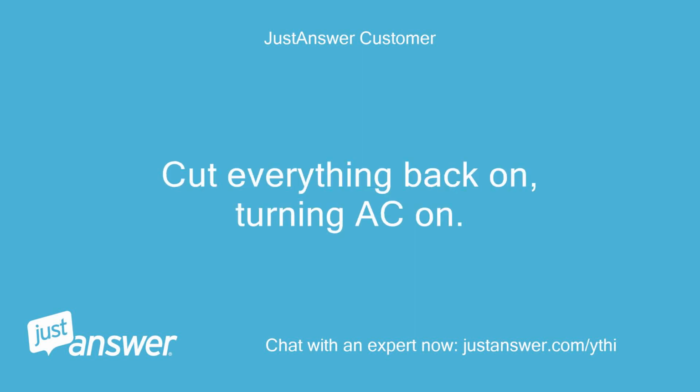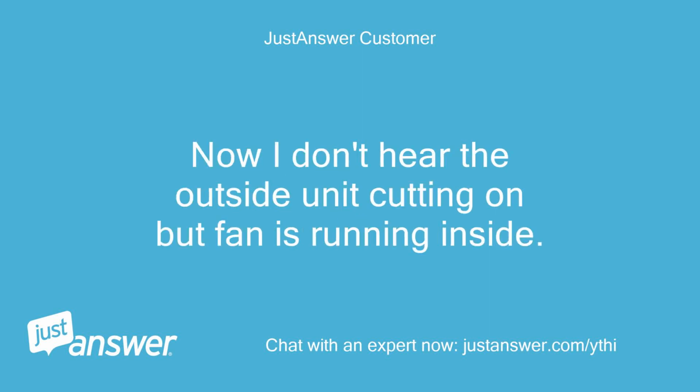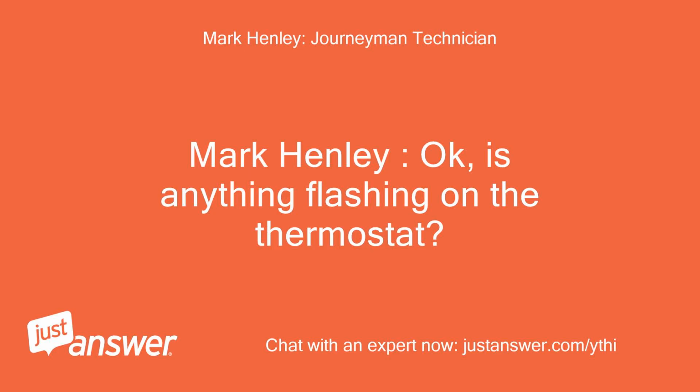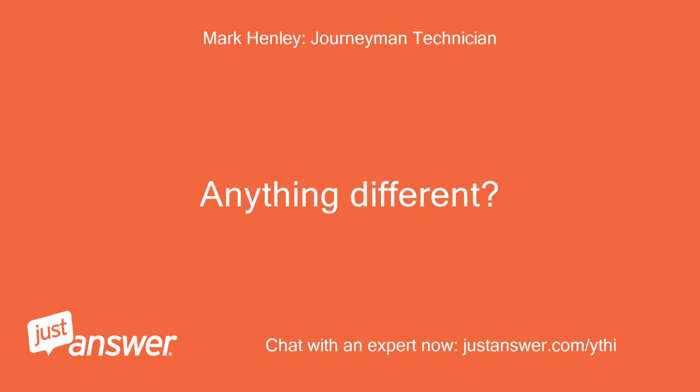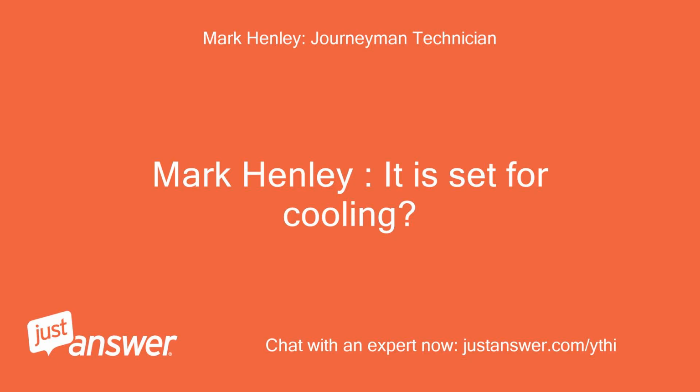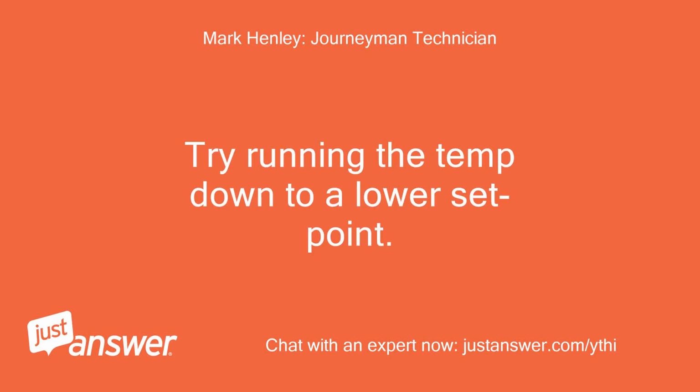Cut everything back on, turning AC on. Now I don't hear the outside unit cutting on, but the fan is running inside. I can hear that. Mark Henley: Okay, is anything flashing on the thermostat? Anything different? No, in settings now. Mark Henley: It is set for cooling? Try running the temp down to a lower set point.